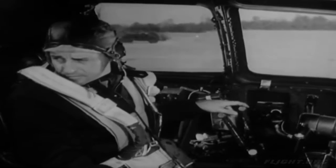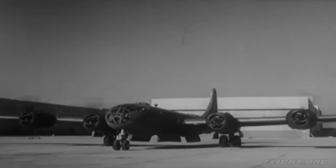You have to push the throttle to 1200 RPM and signal for number 2. The same procedure is repeated until all 4 engines are running. Now that the engines are going, vacuum pressure is available to operate your gyro flight instruments. So the gyro compass and the flight indicator can be uncaged and set. The co-pilot will be doing the same with his gyro instruments.